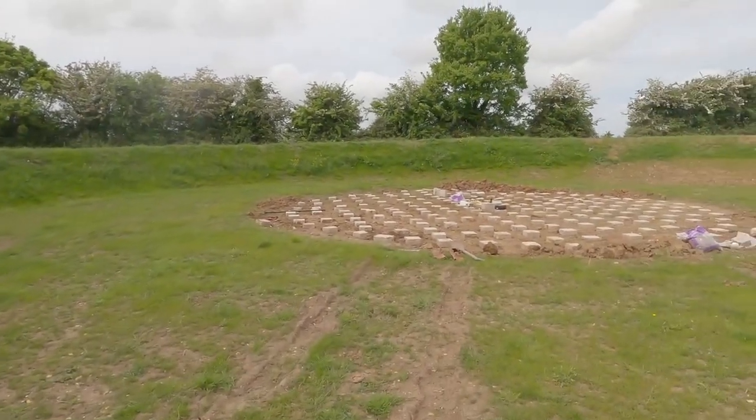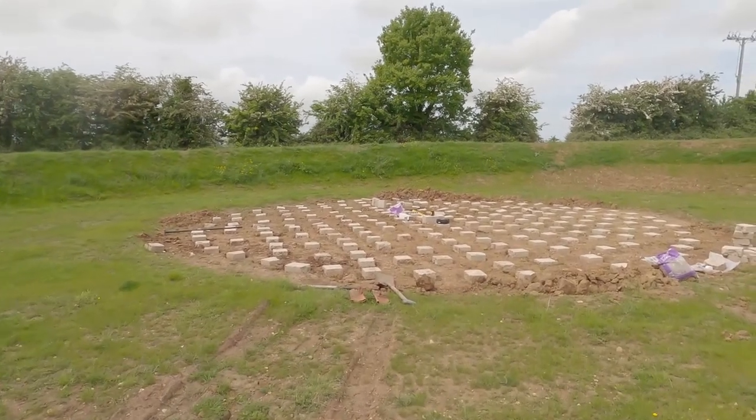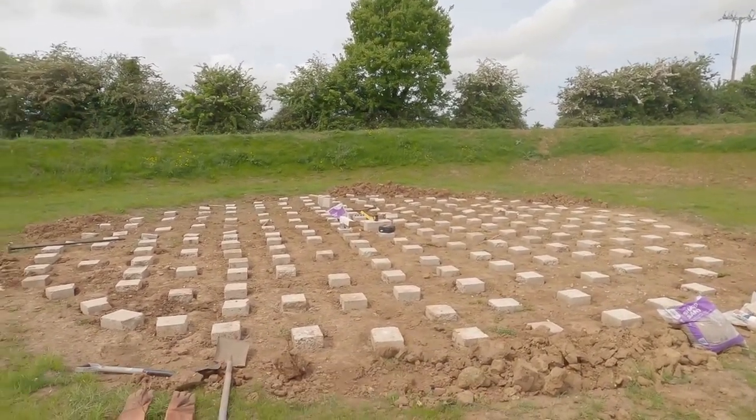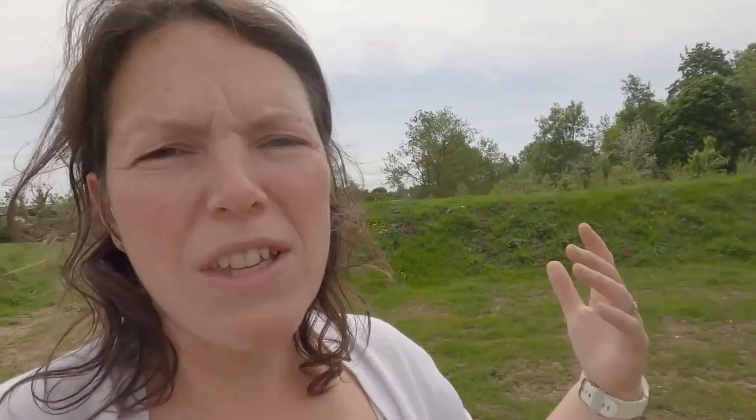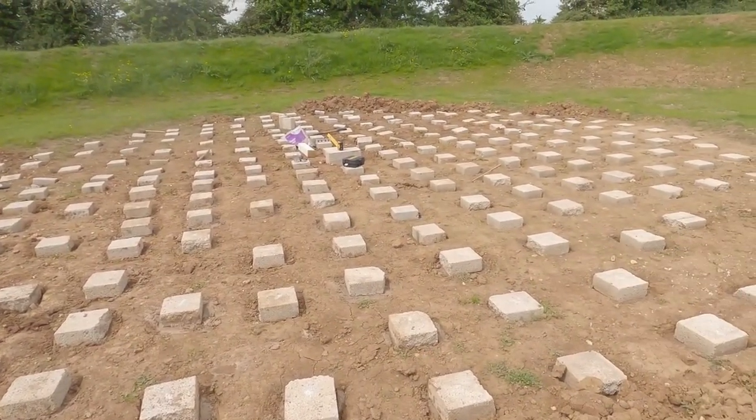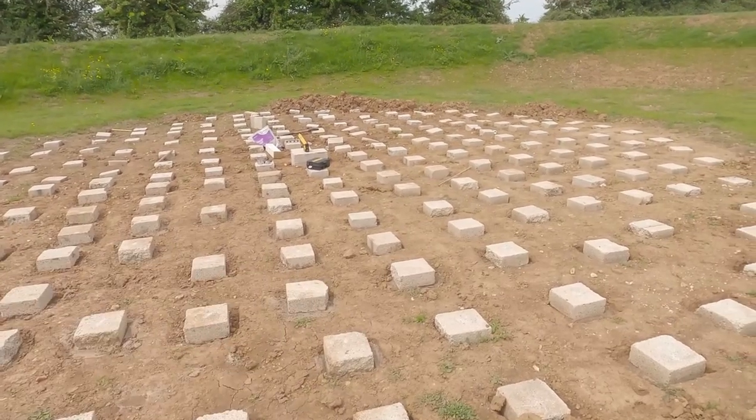However, we're still in this sorry situation of block levelling. I know we've done it in completely the wrong way — probably should have just poured a concrete slab. But because of planning permission, trying to make it as temporary as possible, breeze block and a four-by-two floor and sterling board seemed to be the most sensible solution at the time. There are over 200 of these breeze blocks that we're levelling individually to each other.